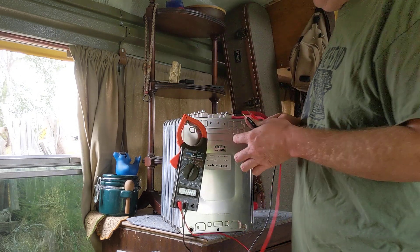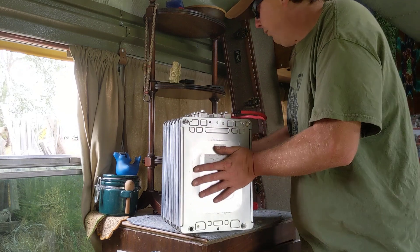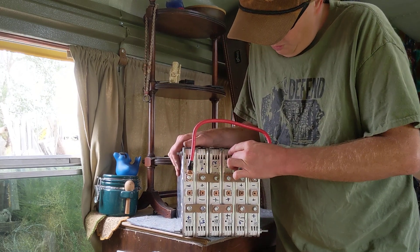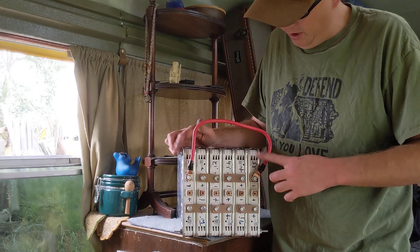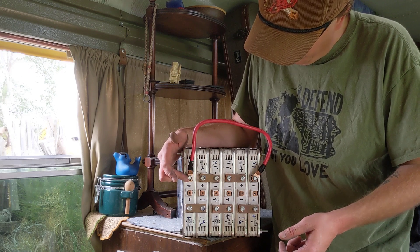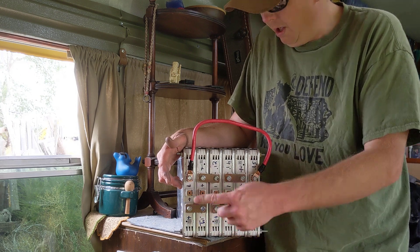Because one pack had been disconnected to do these videos, I've only been using three batteries in my system. Right now I have no power because all my batteries are sitting on top of the power cabinet instead of inside. This would be six modules now — three and three, 24-volt battery, 24-volt battery. We paralleled those two together. This is the parallel positive connection, and this is the negative parallel connection. On the next video you'll see I'm going to connect my charge controller and inverter to these terminals — inverter right here and the charge controller right here.